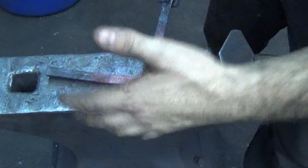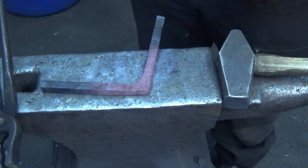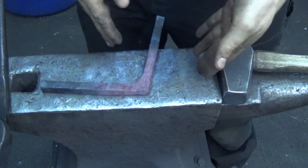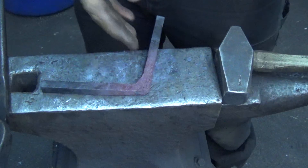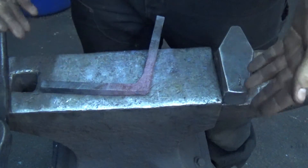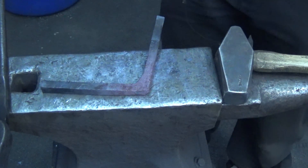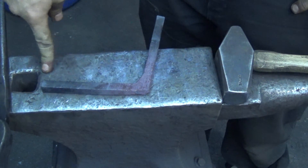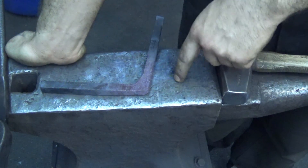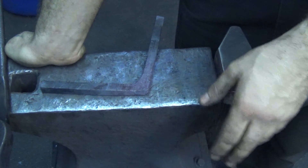The point I'm trying to make here is that welding square corners - you've got to weld, but you don't have to do any math. You can get a square corner just by measuring one bar one length, one bar the other length, and weld them together. Those two segments are going to be the same lengths after the weld, after this is all dressed up. So there's no math, there's no center line you have to take account of. It's pretty quick if you're good at forge welding - obviously today was not my day. But if you're good at forge welding and you're competent, this is a good way to make square corners, and I hadn't seen it before on YouTube so I figured I'd share. Anyway, thanks for joining me, I'll see you next time.